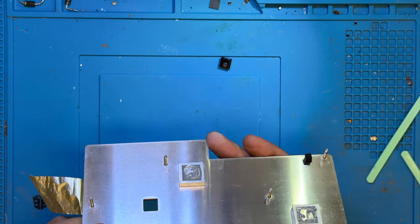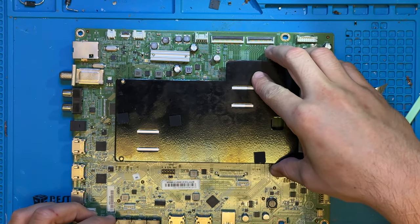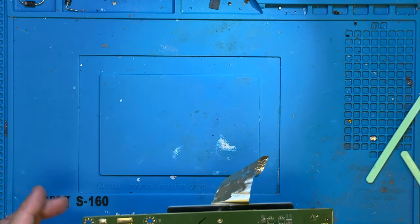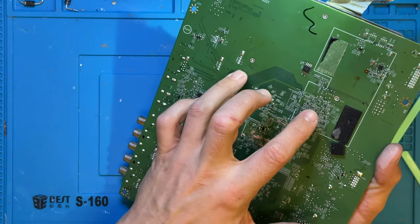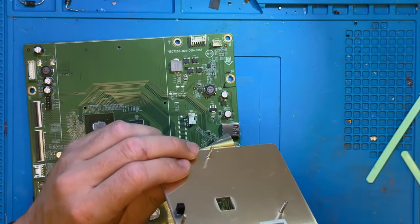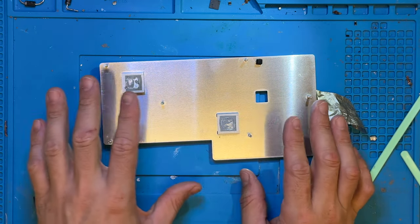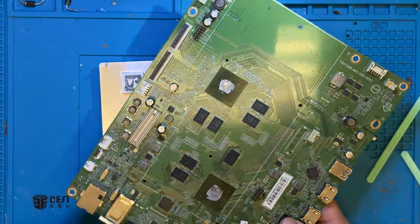These look pretty good — may need one more touch-up. Let's do a quick test to see if we can put the heat sink back on nice and easy. We do have some that need reworking — these three look great, just the last three need a bit more work. The general idea is to make sure these posts fit back in these holes, so after we're done working on the board it's an easy application to solder them back together.